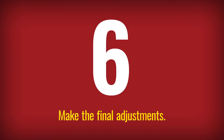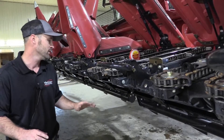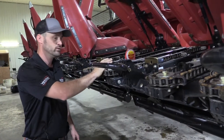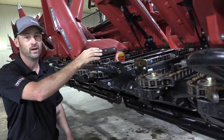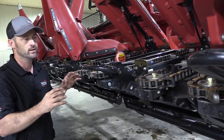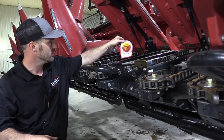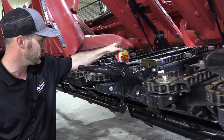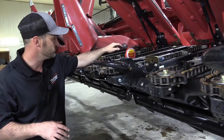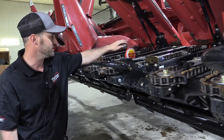Now that we're all finished up hanging parts and basically finished with the install, the last thing we want to do is go through and check all your nuts and bolts, make sure you have everything tight. Just give it a general once over to make sure everything's installed correctly. The next thing we always recommend is setting your deck plate angle — it's the number one phone call we get. To do that, let your head down to operating height and set the meter that is standard in all Devastator kits. Set that on the deck plate and at operating height you want that deck plate to be at about a 23 to 24 degree angle. If you ever have any plugging issues or issues with it not flowing or feeding correctly, check that and it will solve a lot of issues.